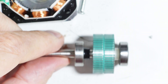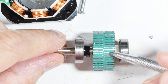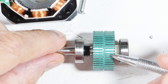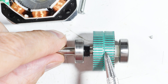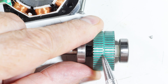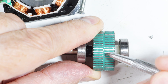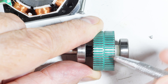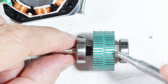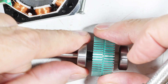That is kind of interesting. These magnetic concentrators right here — you have one, and then it's separated by green and another one. This lines up with the green one, so this is split into two halves. These are out of phase, out of step, so that they can make it turn. It'll grab this one, and then go to here, and just keep doing that. My guess is that's how they're getting the finer precision. There's a bearing that comes off pretty easily, so that's probably worth salvaging.